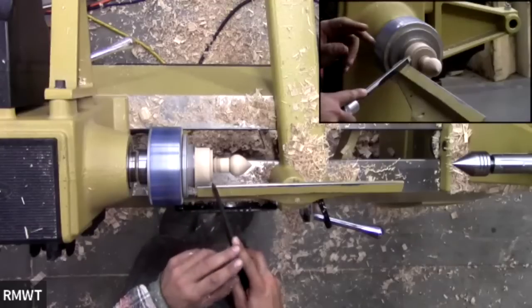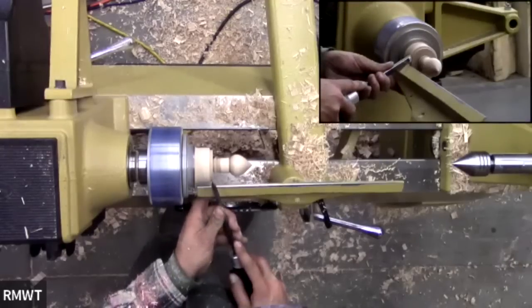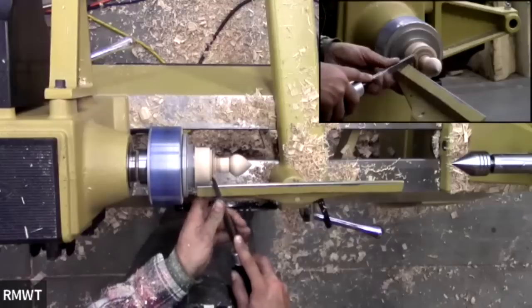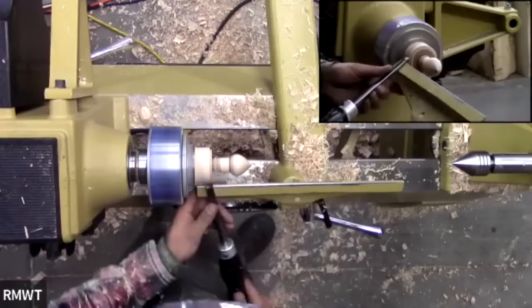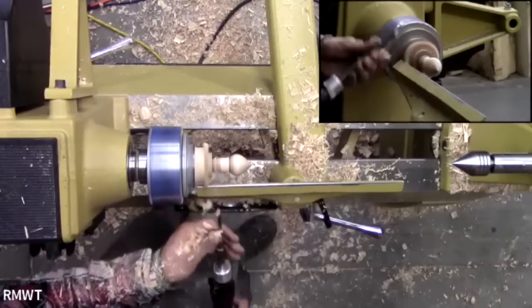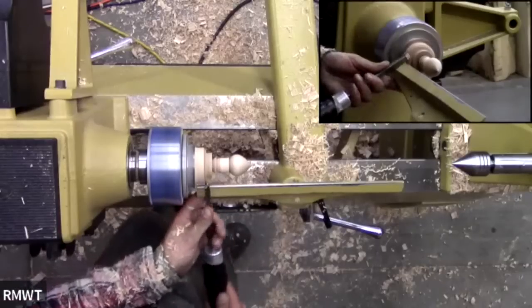It's really more commentary on knowing exactly where that V groove begins. So it's right here. And that's about 1/16 of an inch or less. And then I can rotate the tool with the unsupported edge going into the end grain, but not actually going into it. So that's just a little bit about truing up end grain. Now we'll go ahead and see the contrast. We know how to do that. So we see those fuzzy fibers. Who cares? We can get rid of them in an instant, just like that.